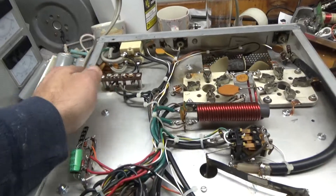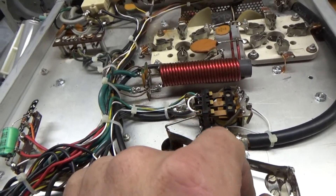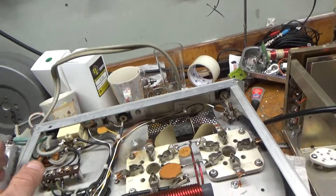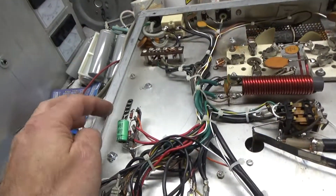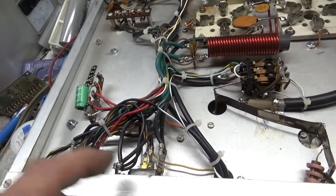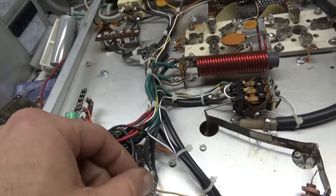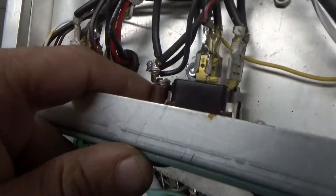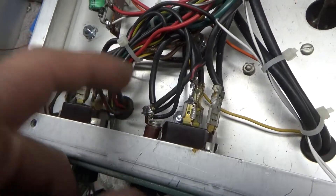Wired for 120. Cleaned the TR relay. Replaced the wire for the relative power meter. Soldered and heat shrunk the wiring for the fan — no electrolytic cap. Fixed solder joints over here, and pinched these so they would be nice and tight when pushed on the spade terminals.